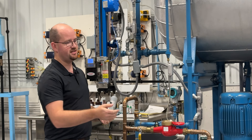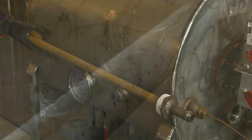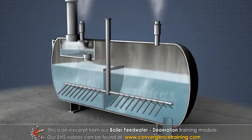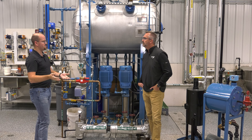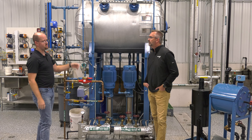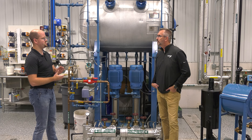Whereas with a small condensate tank or preheated feed water system, you're actually going to be just running a sparge tube in the bottom — basically a pipe with a bunch of little holes in it. We run steam through there, blasting the steam up under the water and heating it up that way. We're also using a little bit of that mechanical force of the driving steam to get some of the oxygen out. These tanks are completely vented, atmospheric — no pressure on them at all.